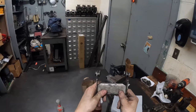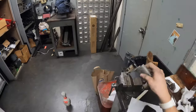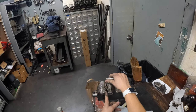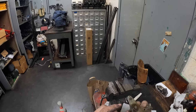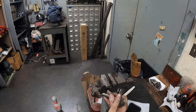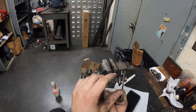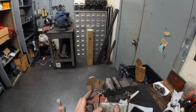I'll start by showing you how I straighten them. This may not be how the book tells you to do it, but this is the way I've always done it and it's worked every single time. You don't want to clamp down on these rollers too hard when you put it in the vice, because you can actually clamp it so hard that it will start to bend this part of the bracket. As you can see, it looks like the last person who did this was close to doing that - it's not totally straight but it's not to the point where it's going to cause a problem.